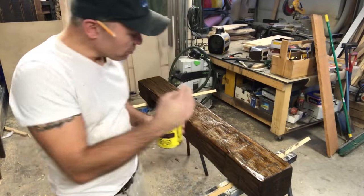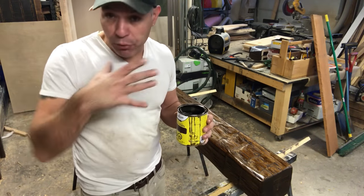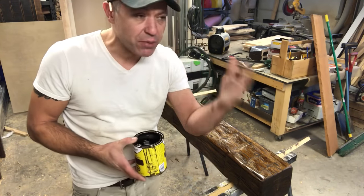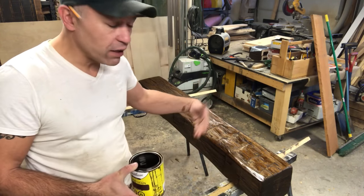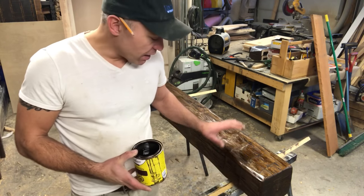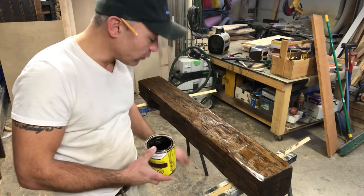For this barn beam we decided to use Varathane dark walnut — it's a wood stain, really good product. It's not the cream of the crop out there, but for a fireplace mantle it does a great job. The way I stain fireplace mantles is to always do the back side first — the side that's gonna be against the wall — so you can see how the color is gonna be, then you just rotate it onto each side. What you see here are little triangles made out of wood so the mantle itself is elevated and not sitting on the sawhorses — a little trick we have here at Vintage Ideas.